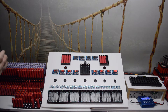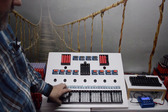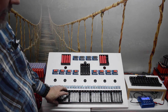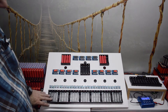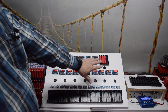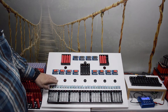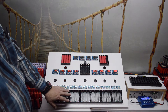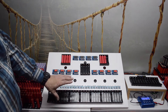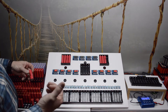We're back at the charging table, which I created after starting to work with charging about a year ago. This table does 28 cells in charge mode and 12 in discharge. Every section is independently switched, so if a cell from a laptop battery gets hot I can kill just that battery by switching it off without affecting the rest. They run in independent blocks of four.